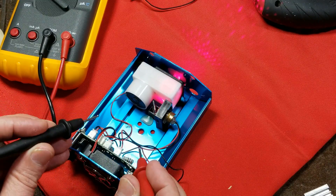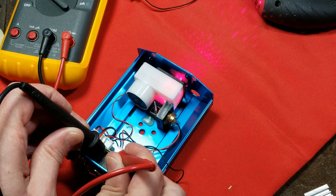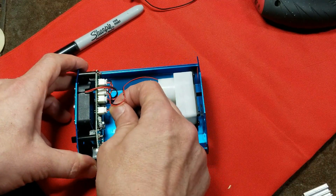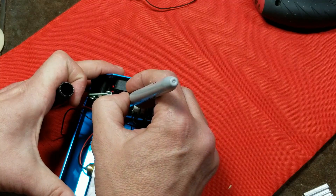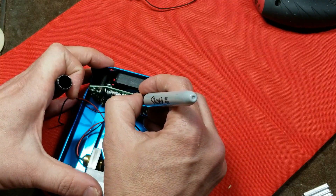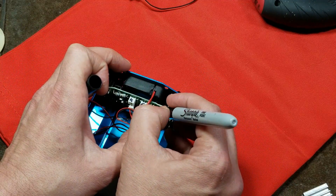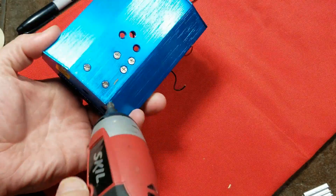I don't think they're running a full 5 volts to this laser — I think it's about 2.3 volts, which is why I'm measuring it. If I ever want to use that laser again, I'll know what voltage it wants. I'm leaving the green wires connected and writing on the connector: R for red, G for green, then labeling the motor and the fan connectors. The microphone is on the bottom. Now let's get the motor unplugged and start undoing the screws.